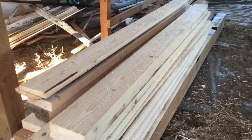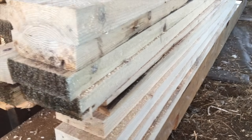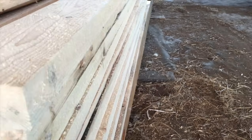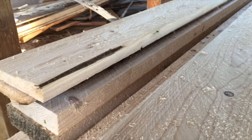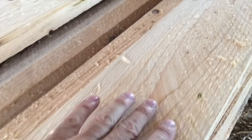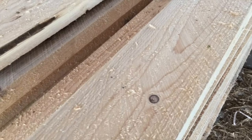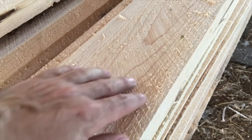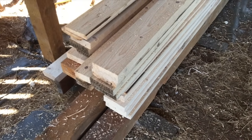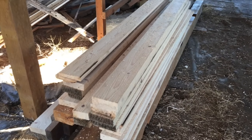Here's a stack of some of the lumber we cut from a grand fir — I had some grand fir logs brought in here. These are full dimension. We got some two-by-sixes and two-by-fours, some one-bys, just whatever was the best yield. You can see the finish — it's a little bit different than a bandsaw blade. You can see the saw marks in there, but a really nice finish. That would be really cool for timber framing. I just can't wait to get started. You can cut very accurately because of the circular blade — I would even argue more accurate than you can with a bandsaw mill.